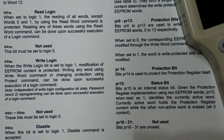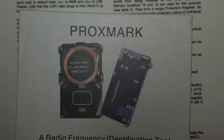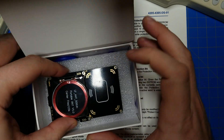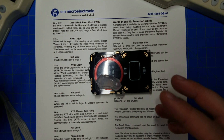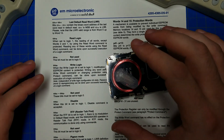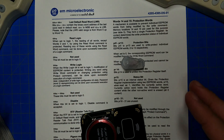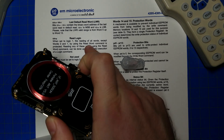So how do you fix it? There's another RFID writer out there called a Proxmark. This is a Proxmark 3 Easy — it's actually a clone. Bought it off eBay for about 70 bucks. It's a device you hook up and connect to your computer over a USB cable. You put your crystal on it, and it has a bunch of commands to read individual bits of information and write to different types of RFID tags, including the EM4305 in the kyber crystal. With this, I was able to clear these two flags and reset the chip back to its factory state. But the only way I've found to do this so far is using a Proxmark — I haven't found any other handheld RFID device comprehensive enough to include setting these individual flags.